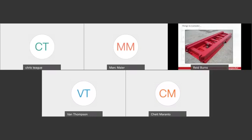And as with most lifting devices, one of the most important things to consider is what's supporting your lifting device. In this regard, gantry applications are no different than crane jobs. It's extremely important that the heavy lift provider work closely with the site controlling entity to ensure that the ground or the floor has adequate bearing capacity. You can have the most thought out, well-planned crane lift or gantry arrangement, but if you're setting up on soil or a surface that isn't designed to handle the load, your day can end in disaster.